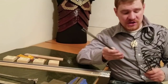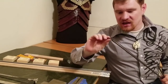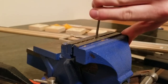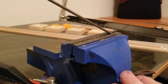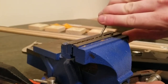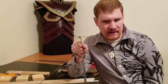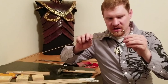Now we're going to take all of the steel rods — the ones that we just cut into pieces and the ones that we haven't cut, but not the one that we set aside — and we're going to use the bench vise to curl the end into a loop. With a little bit of practice, your loops will all start to look about the same as each other. You'll also get the size of the loop right so that it just fits over that eighth-of-an-inch rod.